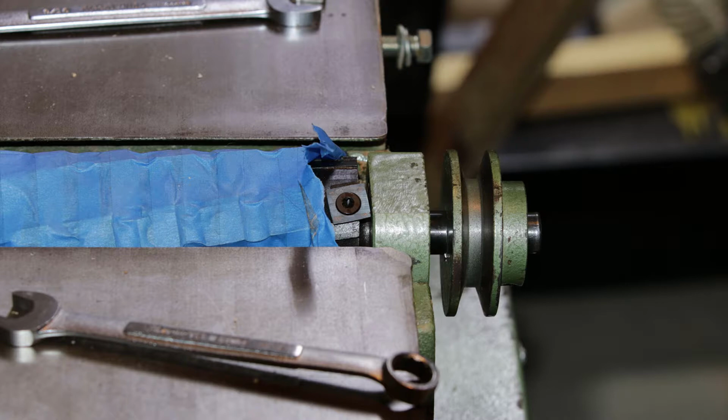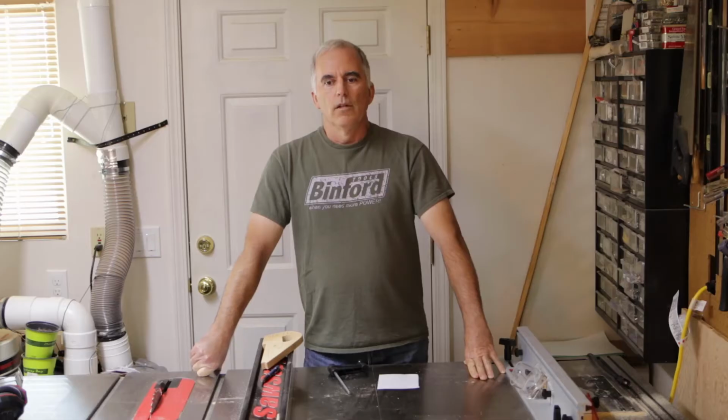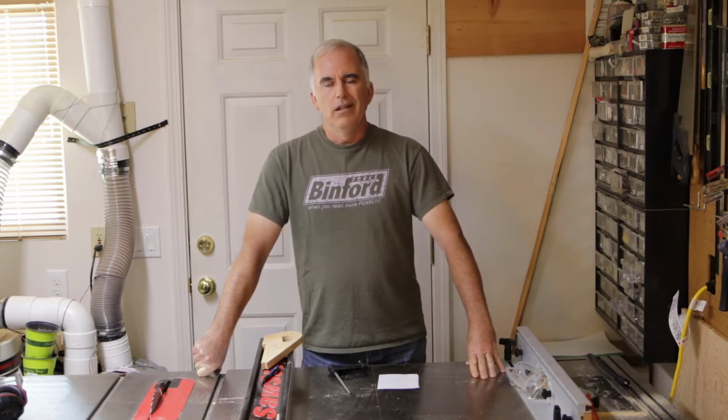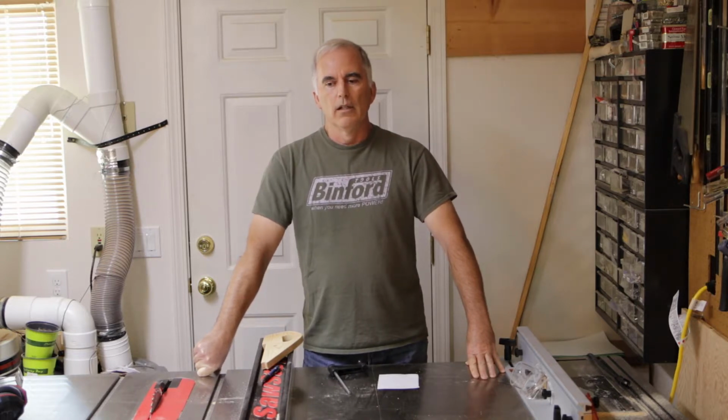It is sticking too far off the edge, and we looked at the rest of our batch, and they're all like that. So he said what I could do is either cut part of that off with a Dremel tool and grind the tip that was sticking too far off so it wouldn't hit, or I could wait until if or when they ever made any new ones for that jointer, then they would replace it.